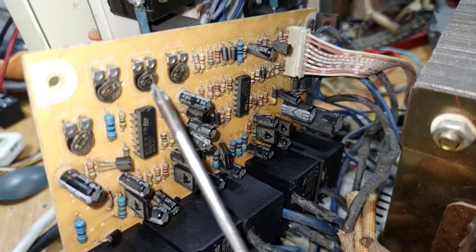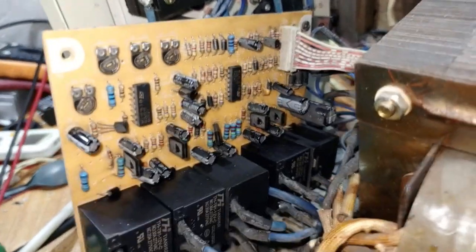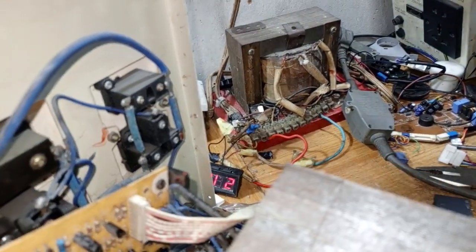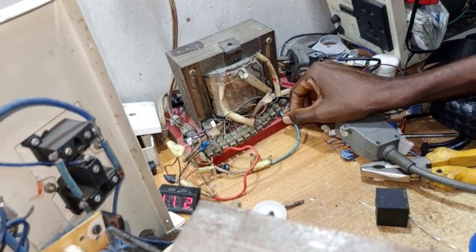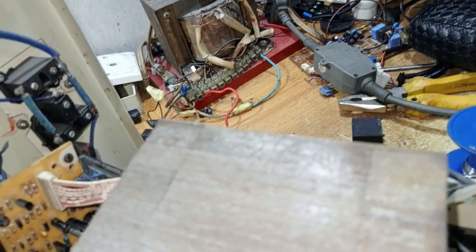Let me turn it on. My meter here is showing 283 volts input and my output is 240. At first it was giving me more range, so I used this center variable to take it down to 243 — which is still okay. Now let me pick a lower voltage. At 220 volts input, watch the output: 236 volts. It is when I start going down from 210 that I notice something different — and that is where number two and number three come in.